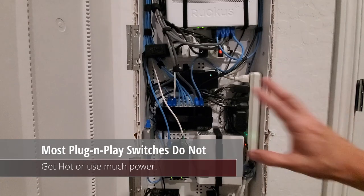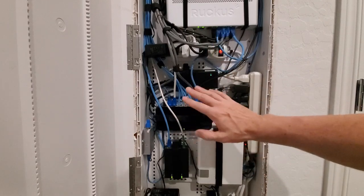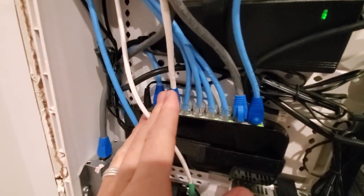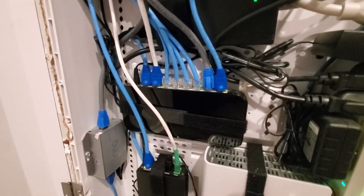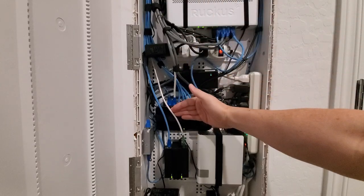The next thing I want to talk about is the location of our switch. This is our TP-Link 8-port switch. The reason why we have it down below and not at the top is because this is a central place for all of our CAT 6 wires to come in at once. You can see them all come in. It's a good location and the heat coming off of these devices will just bypass the switch — this doesn't get hot at all, but it's a good place for everything to meet up at one spot.